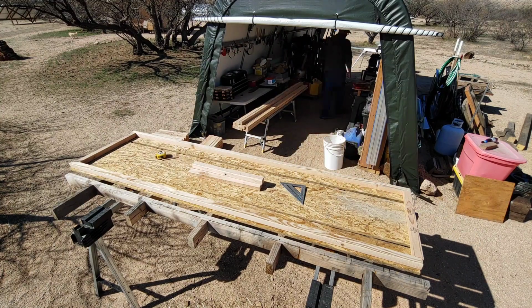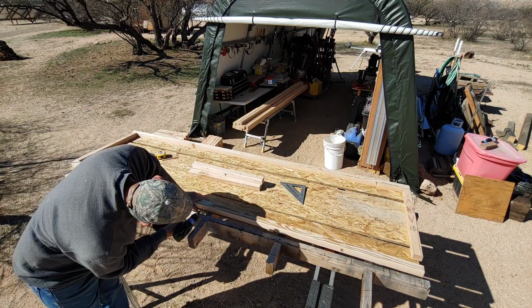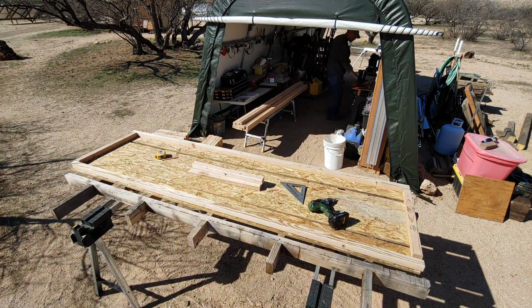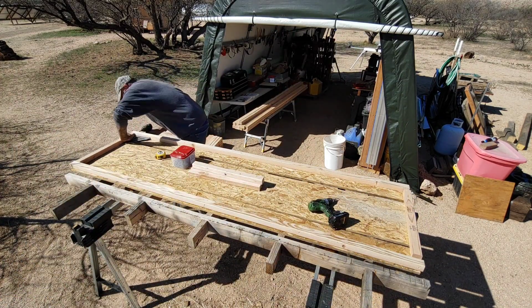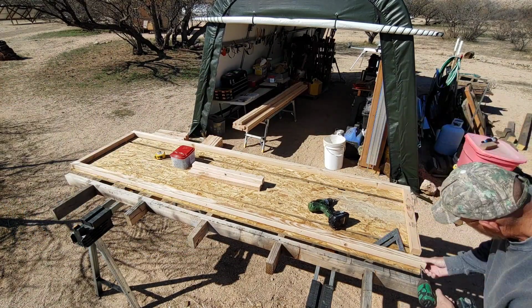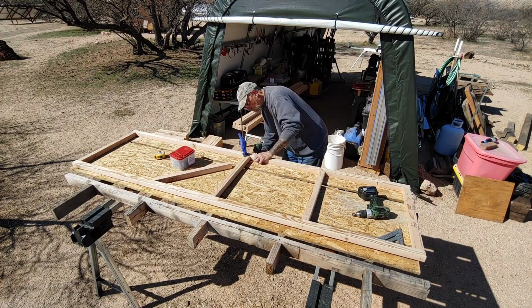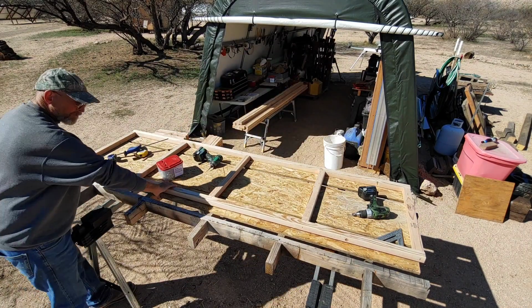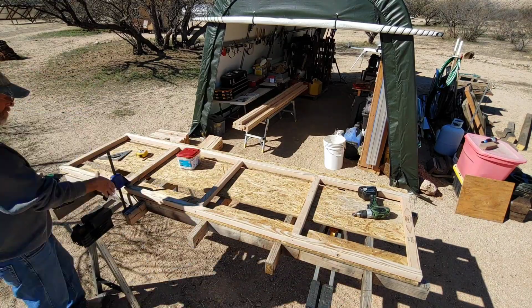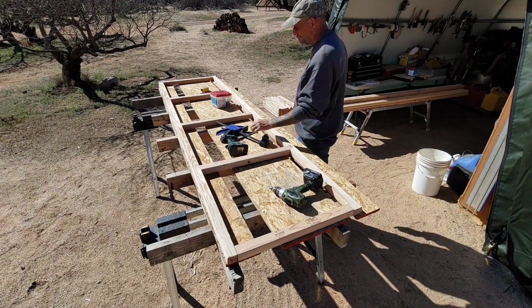After laying out all the wood and deciding where I want the vertical pieces to go, I begin pre-drilling for the screws. I'm also using a countersink bit. One thing I did discover was that the countersink bits can be very fragile. I actually broke three during the entire build process. I used 2.5-inch exterior grade screws to make the connections.